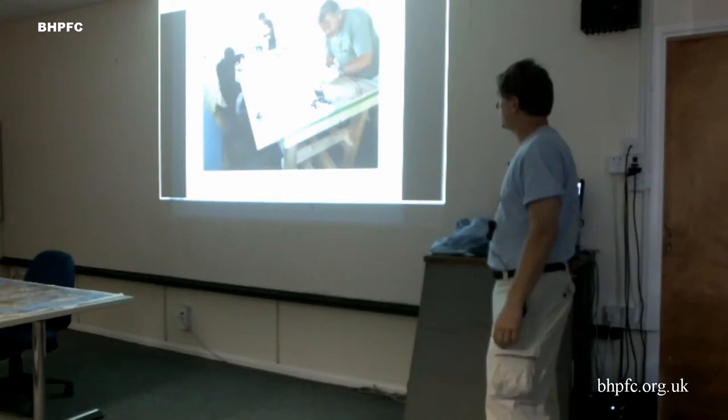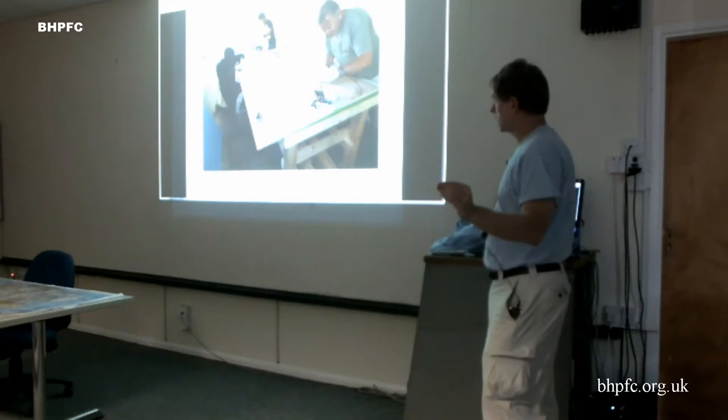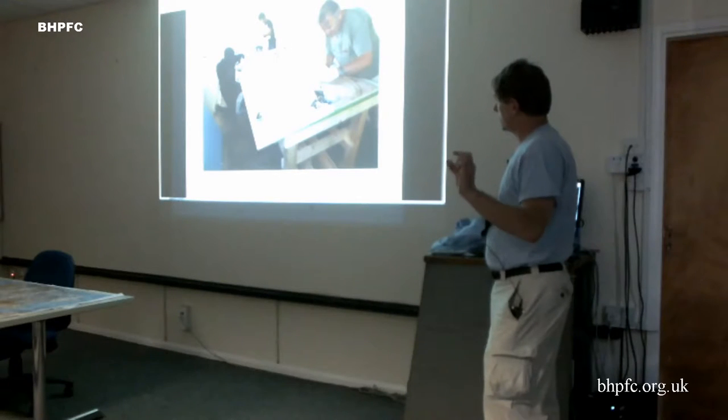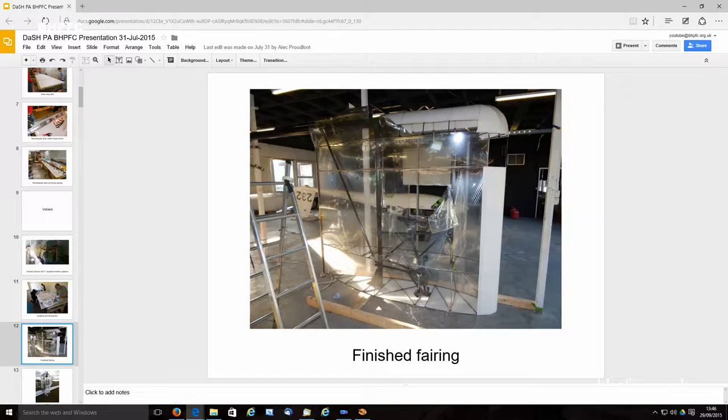So we just made a bunch of copies of those ribs with balsa wood laminations, 1/16 inch thick, four of them, for a 1/4 inch cross section, and then used very lightweight carbon fiber tape to strengthen it. And in the end, this is what we came up with.